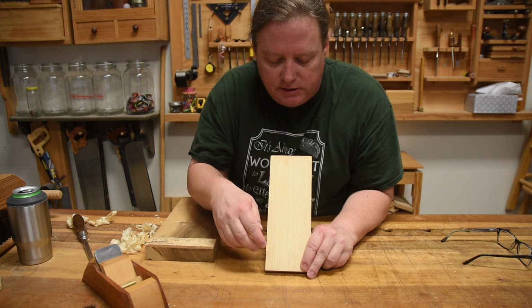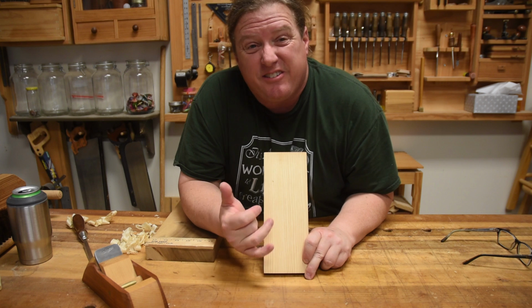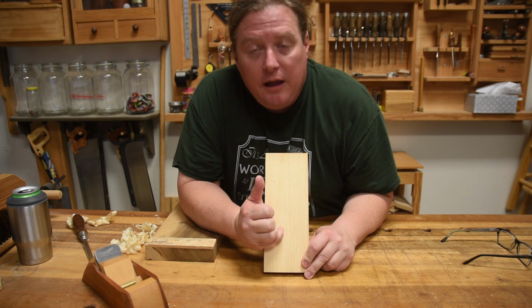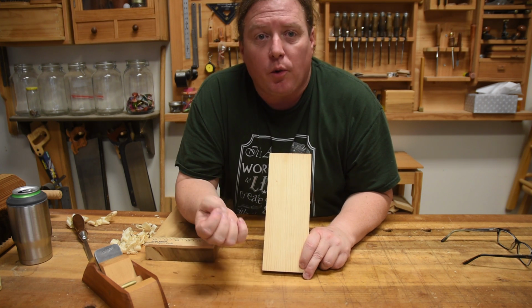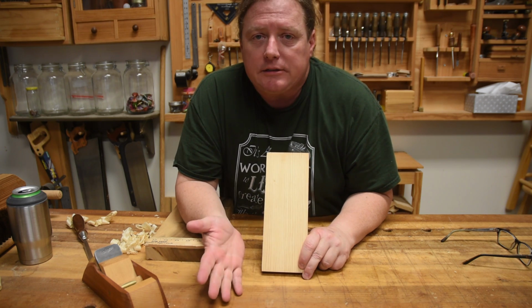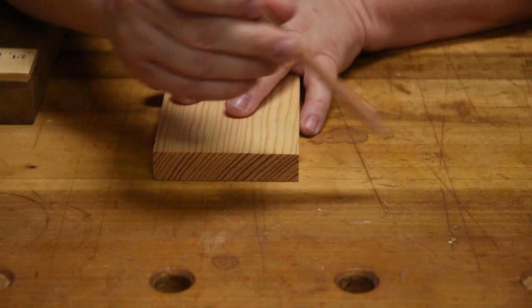You can tell that one because if you just look at the board, the grain's kind of running straight, somewhat boring. And you can see the late growth and early growth in the color variations, where it grows fairly fast in spring and summer and stuff like that. And then it kind of pares back during winter. It doesn't grow as much, so you get darker growth rings. And we call them rings because they kind of curve around and form a big circle.